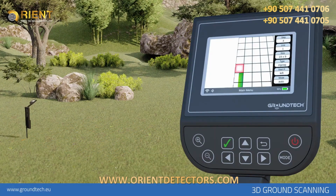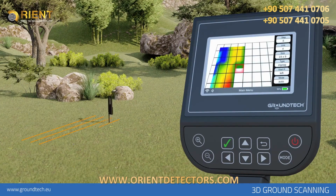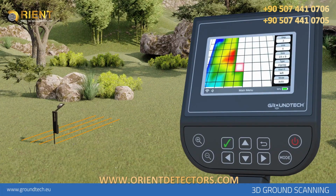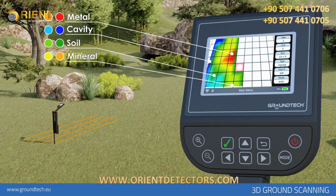During scanning, you will see colors such as green, red, yellow, and blue, depending on the measurements you have taken. All metallic objects and objects with high magnetic effect are mostly red. Some are orange. Underground cavities, filled soils, cavities are blue. You can see the soil as green without any changes and anomalies. You can see mineral soils and objects with a relatively low magnetic effect as yellow and orange.